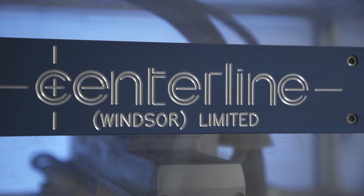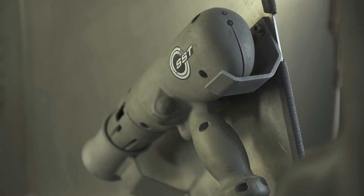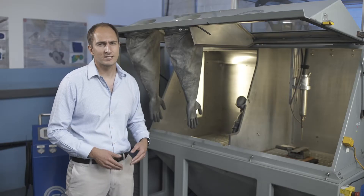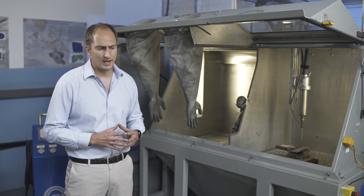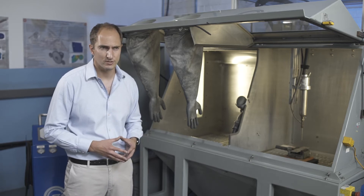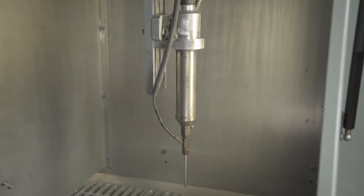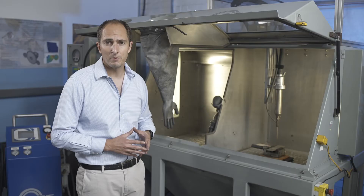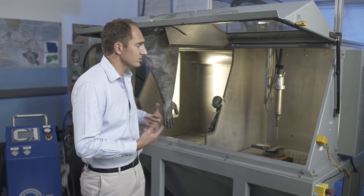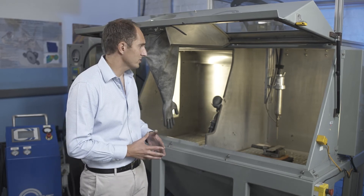The cold spray machine has two distinct booths. There is the manual handgun which sits in one booth — it's not often used due to the fact that you can't accurately create an offset from your substrate, and offset is quite important when trying to get reproducibility of results. On the other side is an automatic gun which uses an XY coordinate robot that moves it in the X and Y plane. If you want to adjust the offset it is a manual process where you undo certain screws and shift the gun downward.